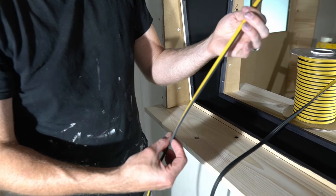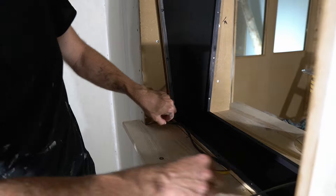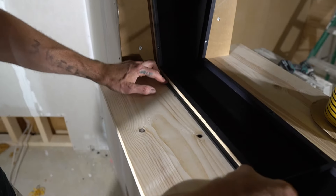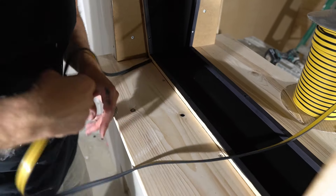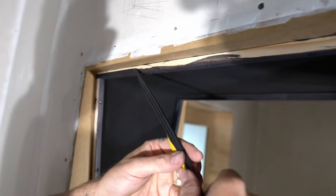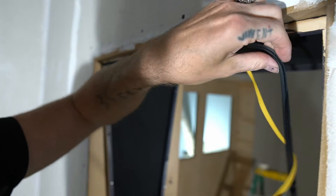I have this very lovely stick-on rubber strip. I'm going to stick that all around here so we've got a nice soft rubber seal for the glass — no rattling. I'll also put in a piece at the bottom for the glass to sit on so that it's all cushioned. Just trying to avoid any kind of rattling. You don't want to pull this stuff too tight, otherwise it will go weird, so just tight enough — don't stretch it too much.